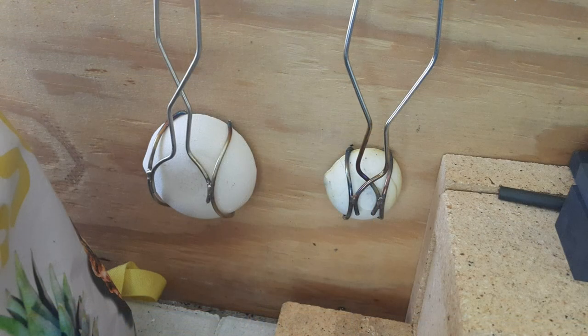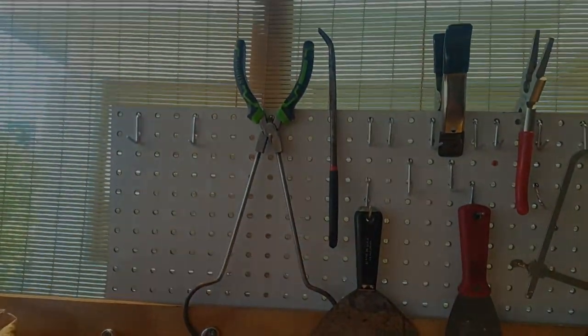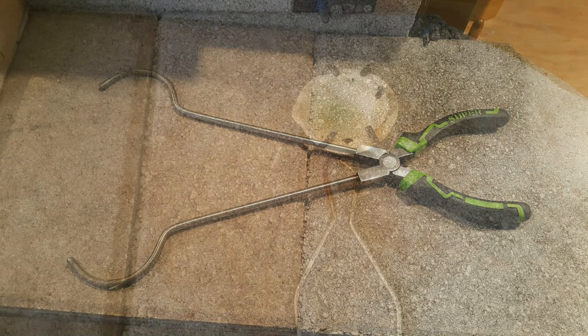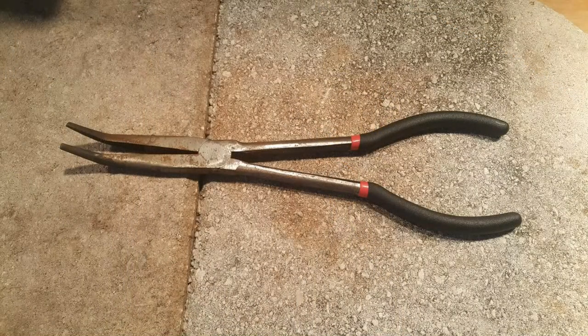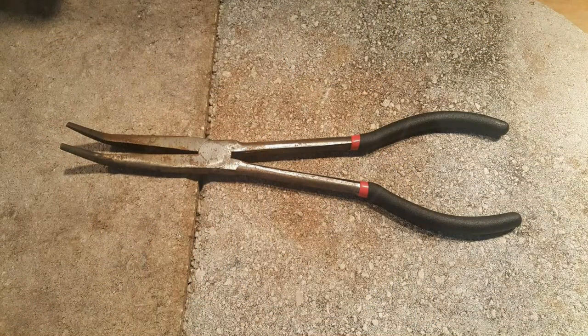When melting small pieces or pulling impurities out of silver, I generally use a ceramic crucible. I have different sizes and will explain how to season them properly in follow-on videos. You will need crucible tongs made for the type of crucible in your furnace, and when using smaller ceramic crucibles you'll need whip handles. I use long needle nose pliers for safely placing silver into my furnace crucible — I don't want to drop it into an empty hot crucible because they're fragile and can break, and dropping a large piece into a partially full crucible may cause a splatter of molten metal. I use the same pliers for handling hot pieces that come out of the mold.